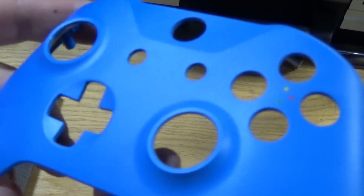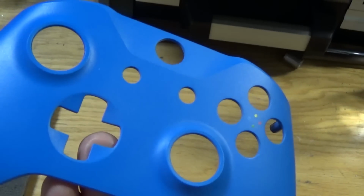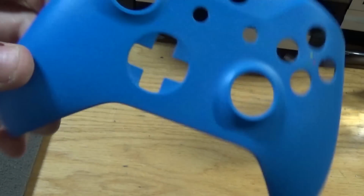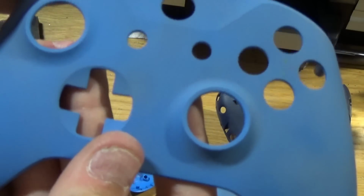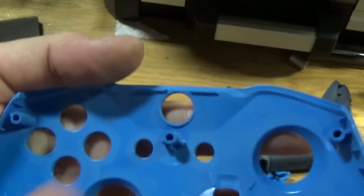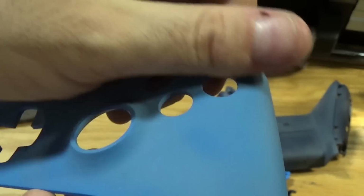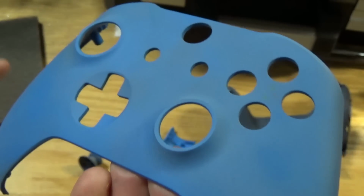On this piece, you can see it's really hard to tell the difference between the side we scuffed and the side we didn't, so I might just throw this in the blast cabinet. And again, 30 PSI, get it done quick and easy. A little bit of sandblasting. Maybe you can tell the difference if I take off some of the sandy residue of the old finish versus what's left. So this is something that the new base coat can grab onto.